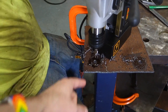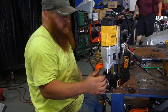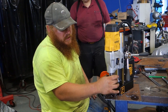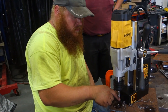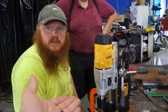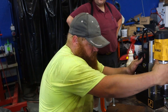With the cooling and all that, it only works with those special drill bits. You can put a regular drill bit in it, but it really wants that drill bit. It comes with a chuck that slides up in here, but you've got to get a little creative. They sell you annular cutters, which are like 50 bucks a piece — so you need to buy one for every size you need to cut. But if you're using it as a job site thing, it's totally worth it. Otherwise, how else are you going to drill a hole in something on the ceiling?